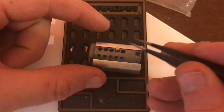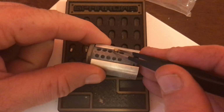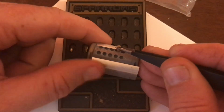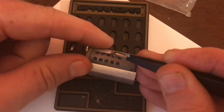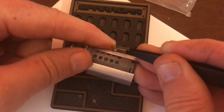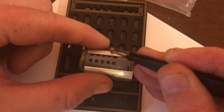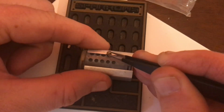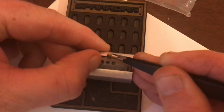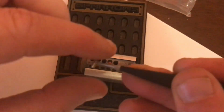Now, of course, the point of a T-pin is that it picks like any normal pin, but as it comes up and rises to the shear line, you suddenly get a little shift in the core, and that reduced portion catches in the shear line. It's having some difficulty here simulating that, but you can see it's going to get hung up and cock at a little bit of an angle, depending on how well your pin generally fits the chamber.